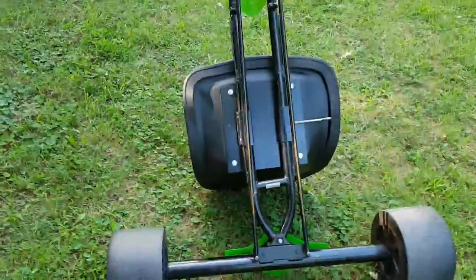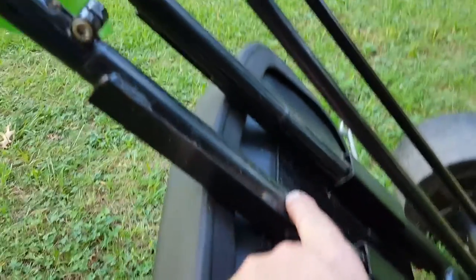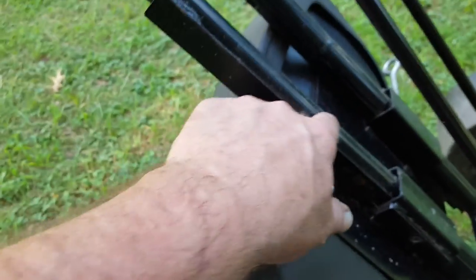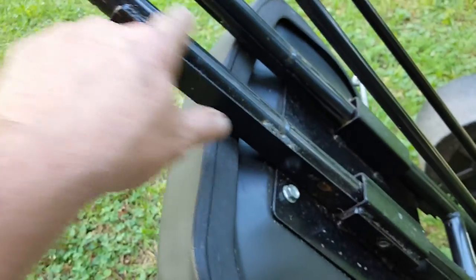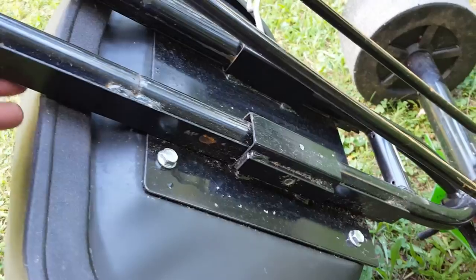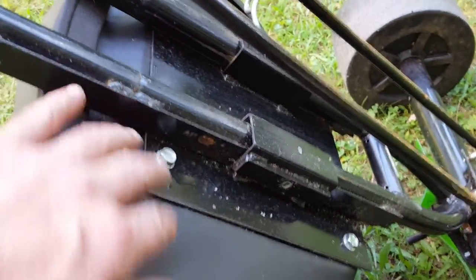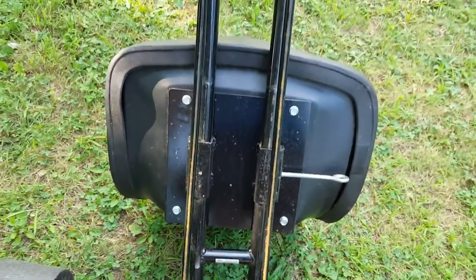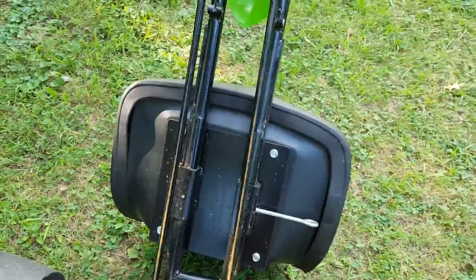So here's the bottom. When you buy this you have to assemble it — this is notched down to fit into this fitting with an allen screw. I added 10 inches of tubing right here and then reinforced it with some angle iron, then used two pieces of unistrut to slide over. Here's my seat mount, and this eye bolt is the locking adjuster for the seat, so you slide the seat where you want it to make the adjustment.